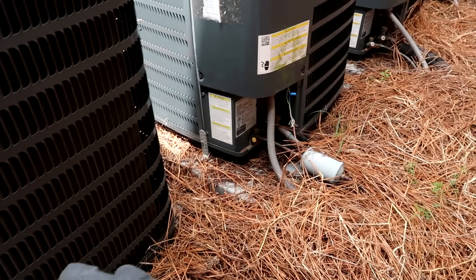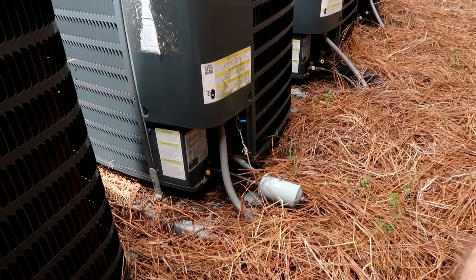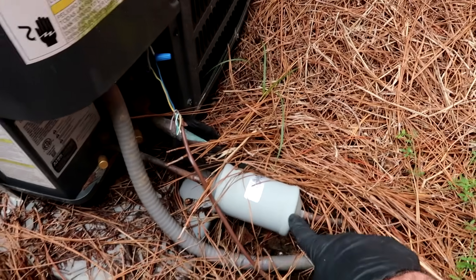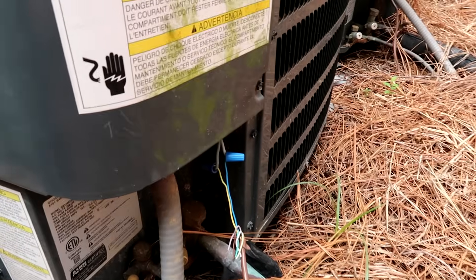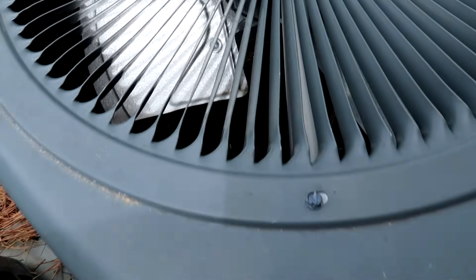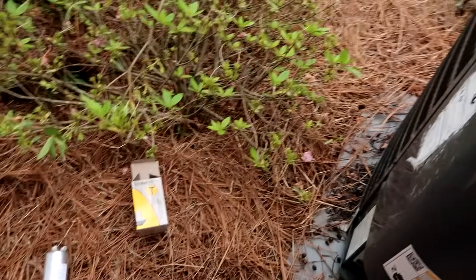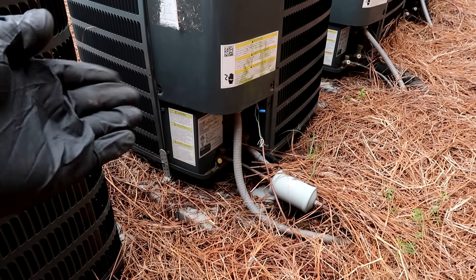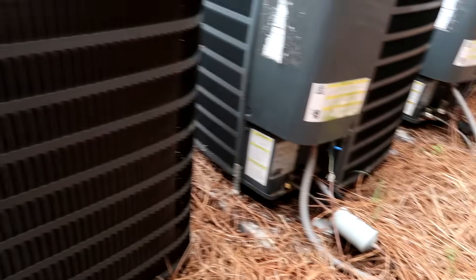Real quick — I was just admiring the unit over here. We had a contractor come out and replace the compressor on this thing, maybe nine months ago. They put a filter dryer on out here, but they didn't take the original one out of the unit — it's still in there. That blue filter dryer there is the one that came with the unit. What do you guys say about that? I know a lot of HVAC guys watch — is that good, is that bad? In my past videos I always pull the one out of the unit and replace it. Not talking trash, just making an observation and wondering what you think in the comments.